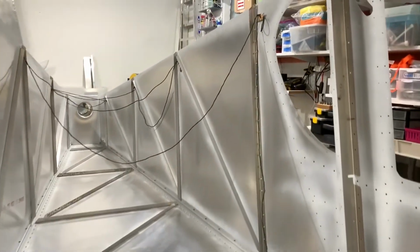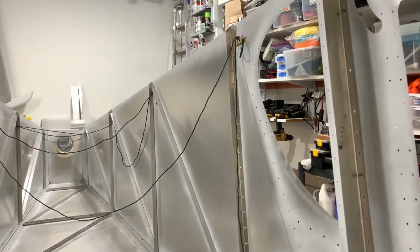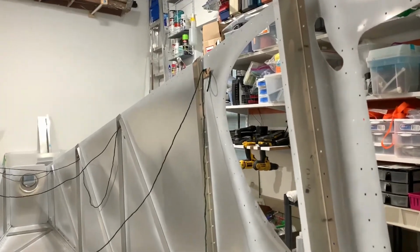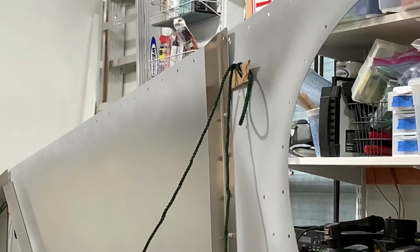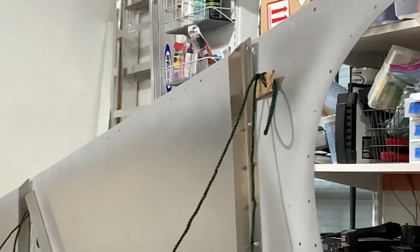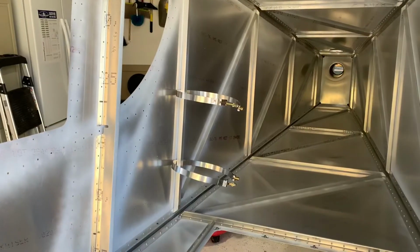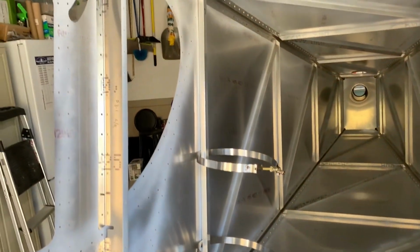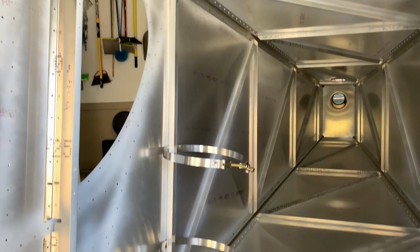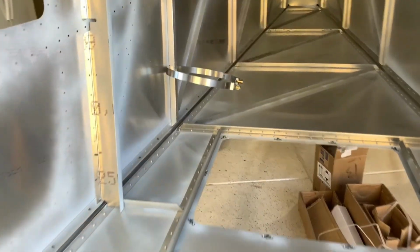All right, ready for the top skin now. I just use little popsicle sticks on the angles there, just to create a little space between the angle and the skin, so then the top longeron can slide down in between all the L angles. And this proved to work out really, really well. Well, here you can see I got the four sides of the aft fuselage together. Those rings are where my header tank is going to go. And in the next video, we'll add a lot more structures to this aft fuselage.